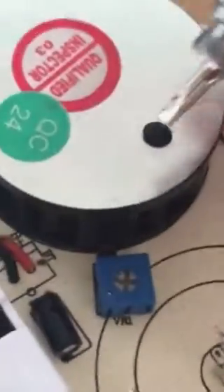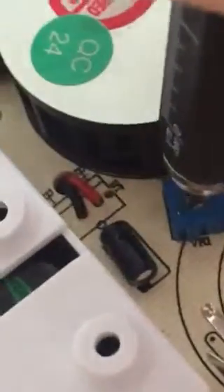I've got my screwdriver and I just pop that into the dial. Once it's in, if you twist it anti-clockwise it reduces the sensitivity; clockwise makes it more sensitive. The problem is this detector has been contaminated because I've been testing it with deodorant and stuff.